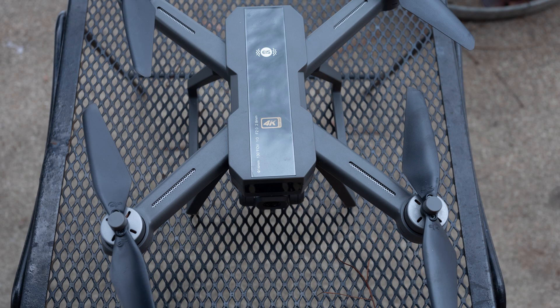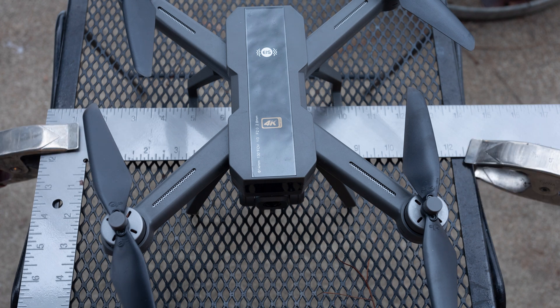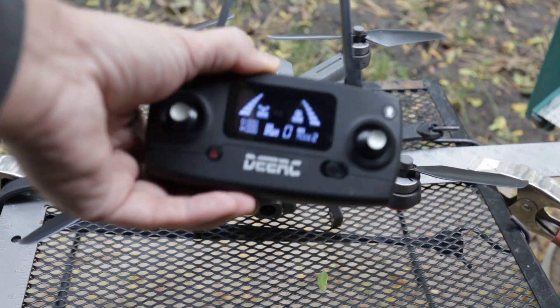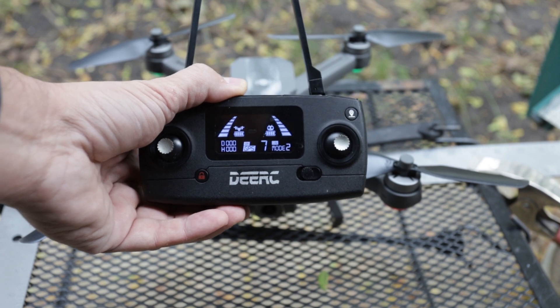So I did something very smart — I built a test bench. In this case it's a small outdoor side table with a metal lattice as a surface. My drone is being held down with a metal ruler that runs over the runner of the landing legs. The metal ruler is clamped to the table so the drone isn't going anywhere. I also put a shock cord through the landing legs as a safety. I turned on the drone, turned on the transmitter, unlocked it, and pressed the automatic takeoff button. This put stress on my drone, which is what I want to do.